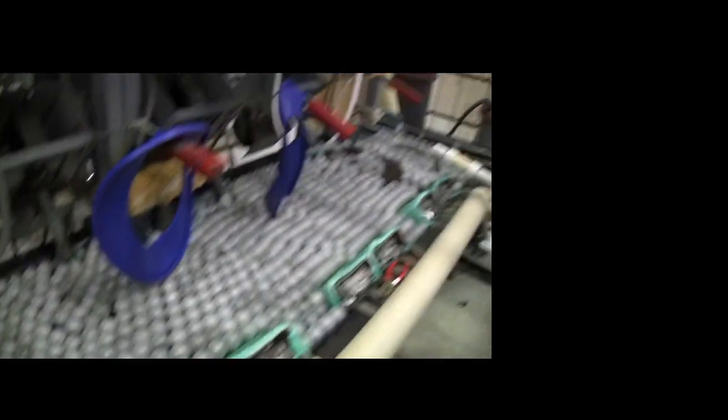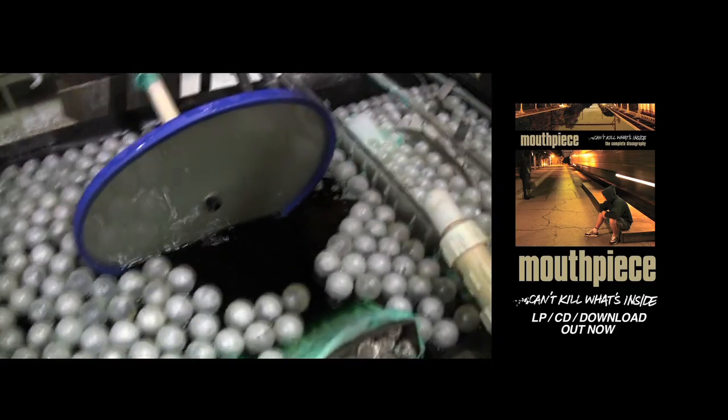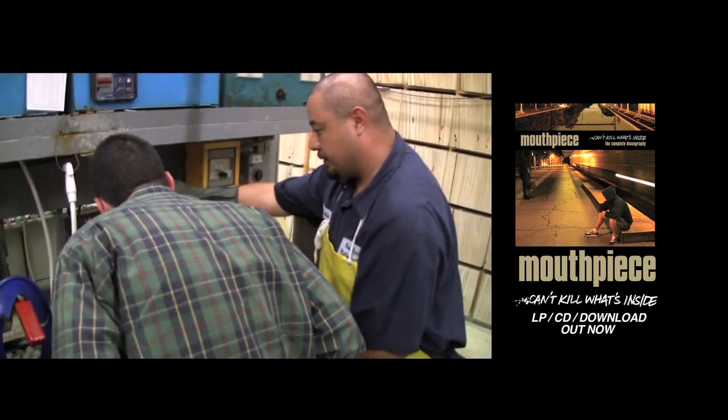After the lacquers get sprayed, they go into the nickel bath overnight, and the electroplating process takes 12 to 24 hours to build up a layer thick enough to make a reverse copy of the lacquer, which can then be used to either press records or make other plates.